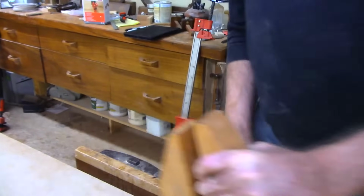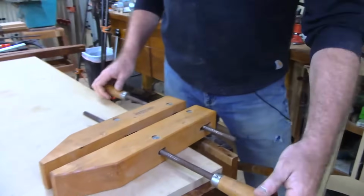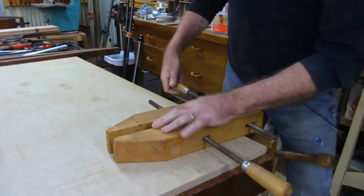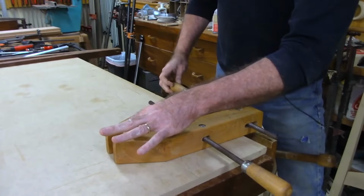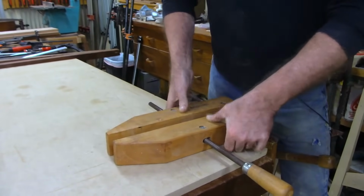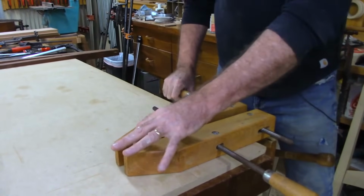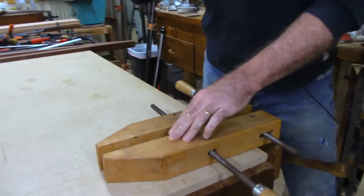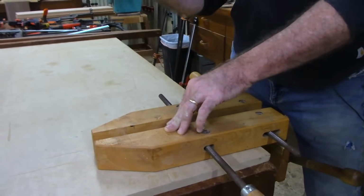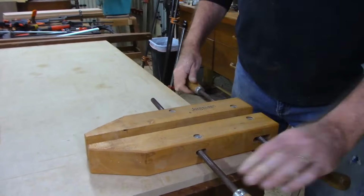And then also, it's really useful. I've used it many times on the drill press, where you can clamp this to the drill press table, and you can hold your workpiece. If it's a smaller piece, you can clamp it in there with this clamp fastened to your drill press. Then you can lock it in, so you have really good control to drill a hole when you need really great accuracy in something small. Okay, you can use this type of jaw that way.